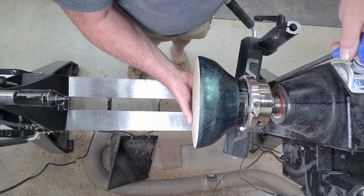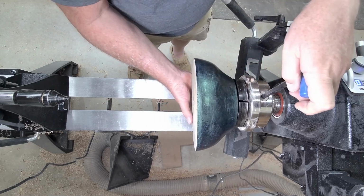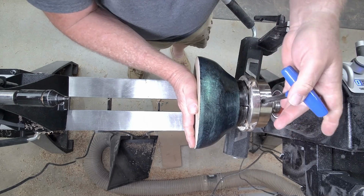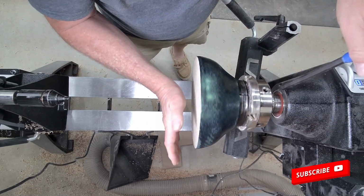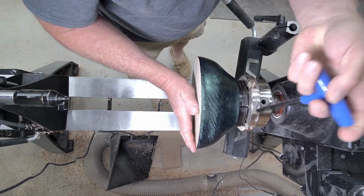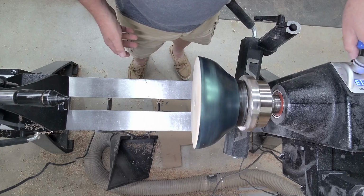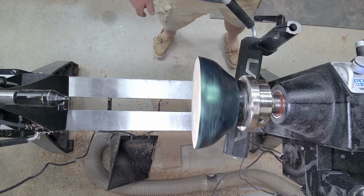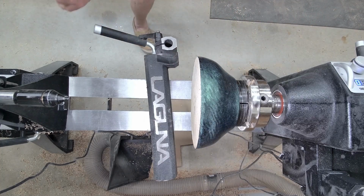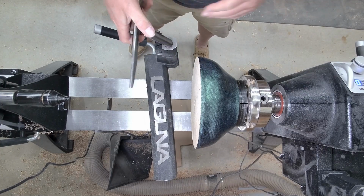So at this point, you've got to be really extremely careful not to have a mistake with the bowl gouge and skid across the painted surface. I use the Hunter Tools carbide bowl gouges for doing the internals. It brings out the material a lot quicker, but it does tear the grain a hell of a lot. So in with the Hunter Tools, get most of the material out, then I'll finally go through with a 5/8 bowl gouge for finishing cuts.